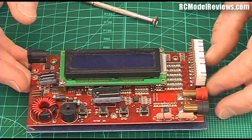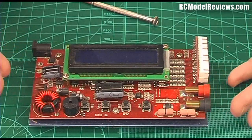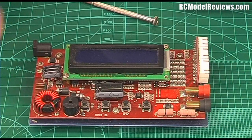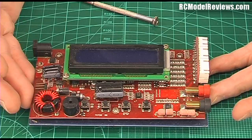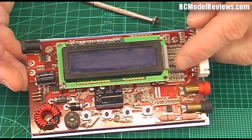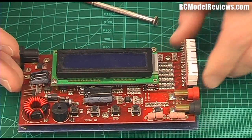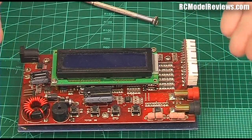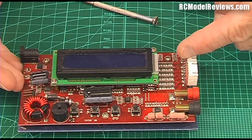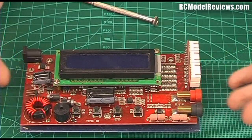When the battery is almost full, some cells will be fully charged and some won't. The way these chargers work is: if two cells of a three-cell pack are at 4.2V and one is at 4.19V, they switch in resistors to put a load on the fully-charged cells, sucking them down. Then they start charging all cells again. So they'll flatten the cells at 4.2V down to 4.19V, then recharge all three to 4.2V. That's why balancing takes time — it has to suck cells down that are too high.